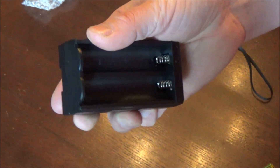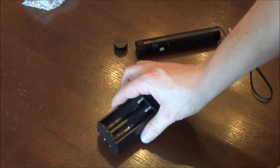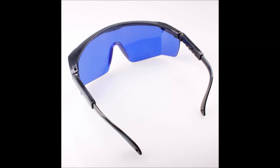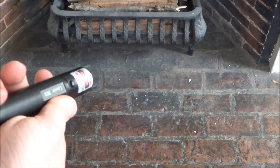Before you start testing your laser, make sure you have a good pair of safety glasses. You shouldn't be looking at the direct dot for extended periods, especially when trying to focus it in to burn something. You'll need a blue pair of glasses specifically — not the red pair that protects against green lasers. The blue pair is for red lasers and is usually only about $5–$10; I'll link them below.